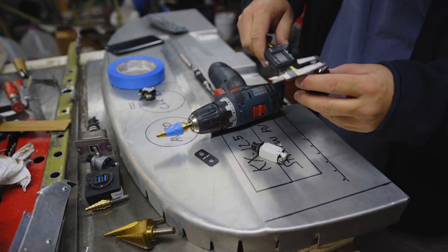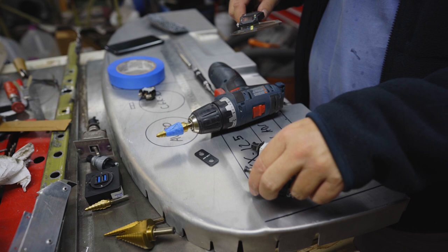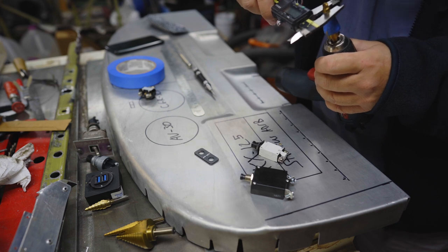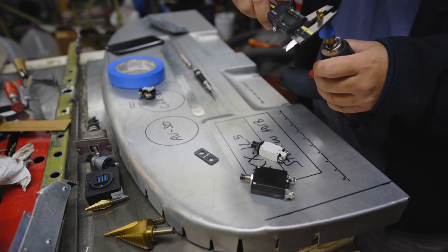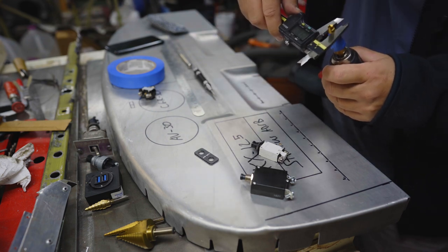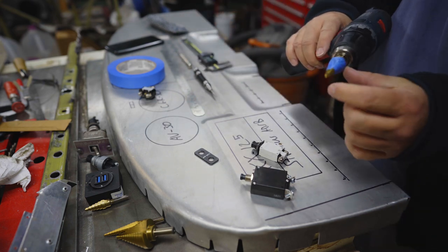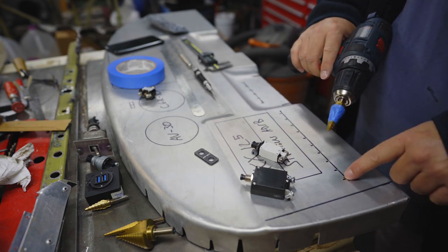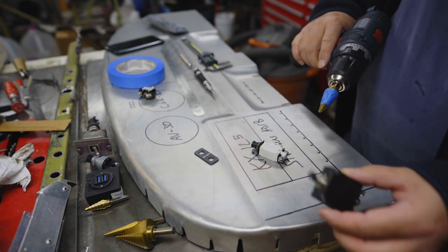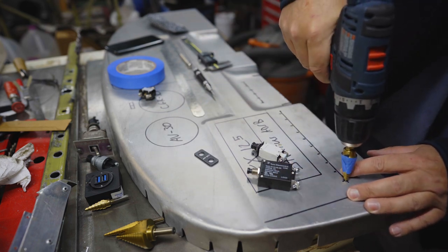All right, this guy measures 369 thousandths. 3/8 of an inch is 375, and this is 3/8. Well, it says 3/8. And that's about 370 thousandths. So I taped it off so I don't go too far. It's the 3rd shelf, so I should feel 3 separate breakthroughs here. And that should work nicely for that guy. This is the first one. Let's give it a try.